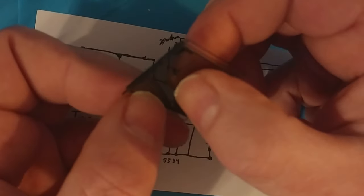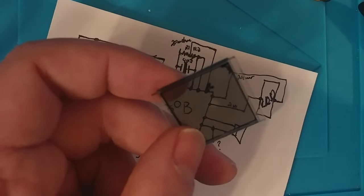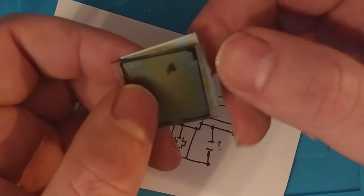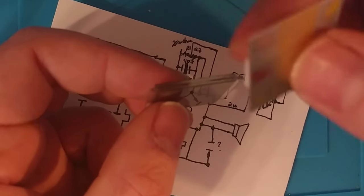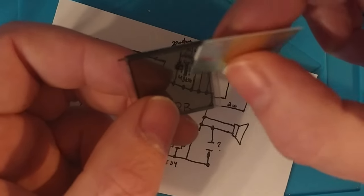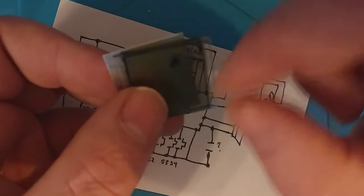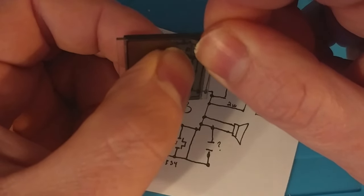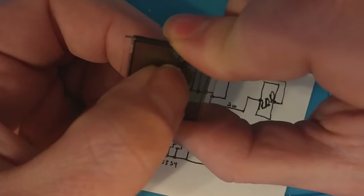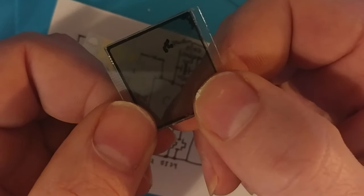There's a thick piece of glass, and it's actually many parts to the LCD. Basically, what you have is a polarizer of sorts, a glass substrate, lower and upper glass substrate, with transparent electrodes, and then your liquid crystal sandwiched in between. And the voltage is passed through there, like from the COB, to excite the liquid crystals to produce a picture for you. But it's going to take me a while, I think, to do this method, so I'm going to try to film what I can, as best as I can, and we'll see how this turns out.